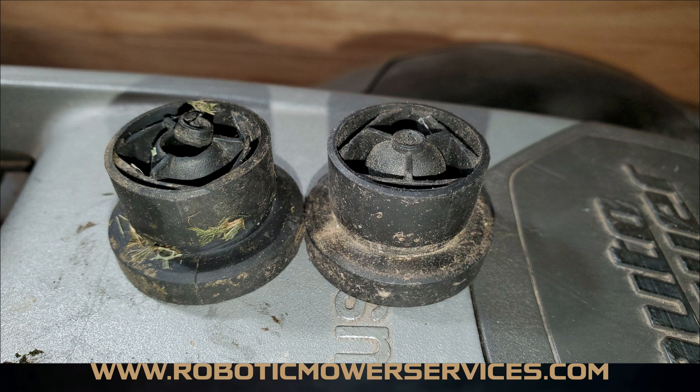Here's what was causing that issue. We have two bushings here — these are the bushings used on the top cover to clip down onto the joystick sensors. The one on the right is a good bushing; the one on the left has the center poked out of it. When the center is punctured, it allows the bushing to go down over the ball end of the collision sensor further than it should, so the ball end is actually pushed all the way up through the outside of the bushing. When that happens, it pushes or manipulates one of the other three sensors because everything is no longer lined up properly — like a chair with one leg slightly shorter than the others, causing a diagonal rocking between the four collision sensors.